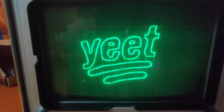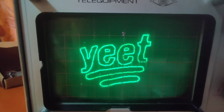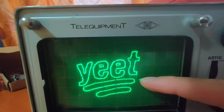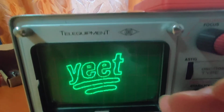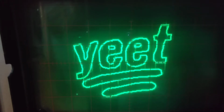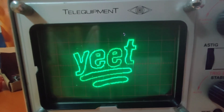You can now see the image is a little bit more choppy, right? The steps in the horizontal and vertical directions aren't as smooth as they were before, because now every bit we add sort of adds another level at halfway between two existing levels, and when we eliminate a bit, we sort of have to jump from 2 to 2 or 4 to 4 levels and so on. And you can see its resolution is a little bit less, but it might still be acceptable, and such a result would be achievable with an Arduino Uno or some other board which has only 14 bits.